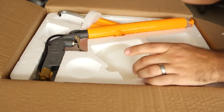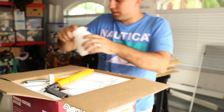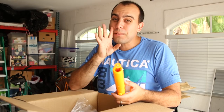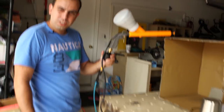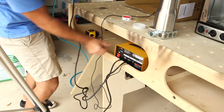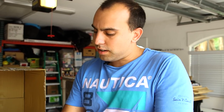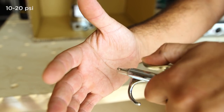If you're just making one Yeti cup this probably isn't very cost-effective. So we're making five of these things, and I kind of wanted a powder coater anyway so this is just a good excuse to get one. There's a little foot switch on the ground — this controls the electricity, which needs to be on first of all. I read online that a good way to tell if you're at a good pressure is if when you spray it on your hand it just barely blows your skin in.